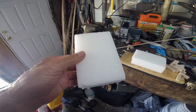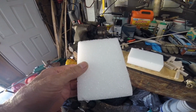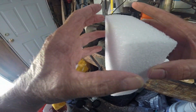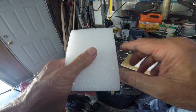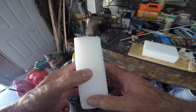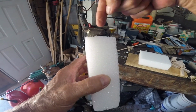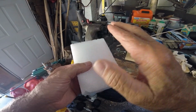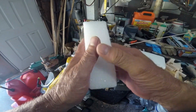Then I'm going to take my bamboo and ipe longbow, and this will be separate, it'll come apart, and I'm going to encompass that bow with this. It'll come in here and fall right dead on that, and I'll adjust it up and down where I want it. Then I'm going to take epoxy sculpt and pack it in there all around that bow. I'll rough that bow up, and I'll put mold release on the inside of this 2-part mold, because if you don't, it's going to be locked up. You'll never get it apart.